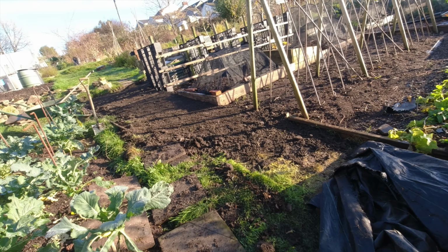I'm sure when I come to put the pavers down, I'll need to adjust here because this bit, I don't know, it just seems a bit lumpy, but pretty much that gradient is smooth all the way down. And as I come down, I can just fill in a little bit if I need to. And then when I've got it all down, I think I'll probably, just for my neatness, put a little bit of soil in here just to make it all the same. So I think the next thing is just to get a bit of a groove out, and I can lay that membrane down and tuck it into the groove, create myself a bit of a barrier, stop any unnecessary weed growth into the growing area.